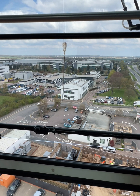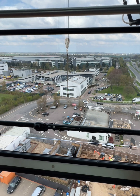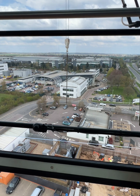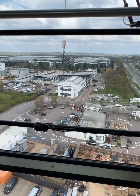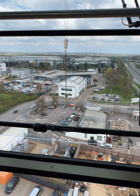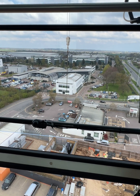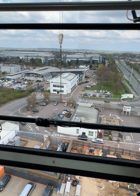This takes a lot of practice, and practice makes perfection. That is the basic way to catch a slow swing: you slew in a direction, you stop, and you keep your eyes on the hook block to see what direction it flows into. Once you can catch the feel of the crane, you will know how much you need to slew to catch the swing. On this particular crane I've caught the feeling — I know how far it moves in first gear and how much it moves in second gear.